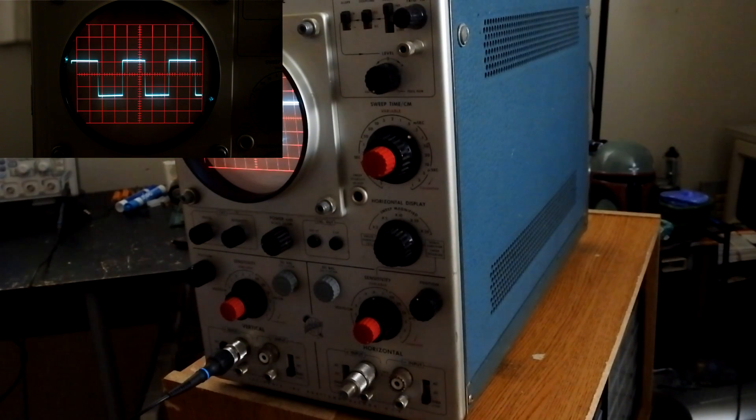As you can see, it works pretty well for being over 50 years old with little to no restoration. Hopefully in the future you'll be seeing more about this oscilloscope, because I plan on doing at least some sort of a restoration series on this. It probably won't be a very long series, since there are very few paper capacitors in here — mainly those electrolytics that need to be changed. But I hope you have enjoyed this look at a Tektronix Type 503 oscilloscope, from around the early 60s — maybe 1963, if I had to guess. Thank you very much for watching, and I'll see you next time.